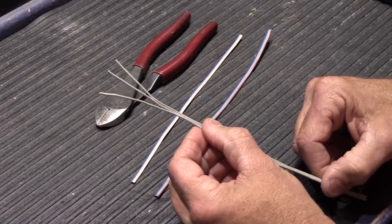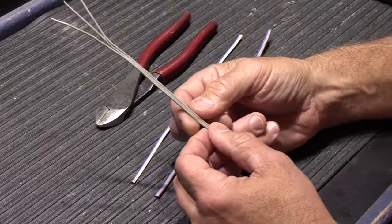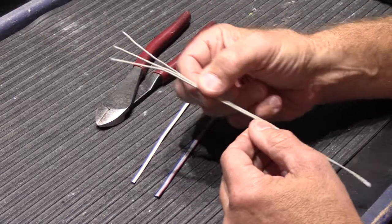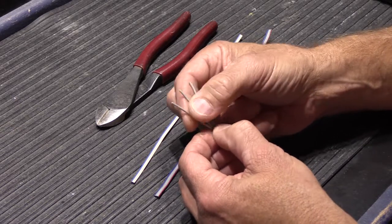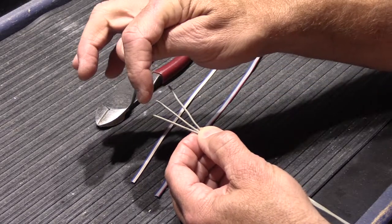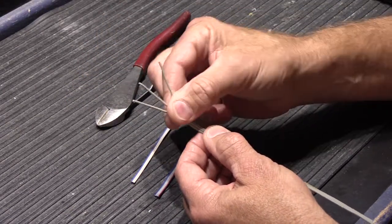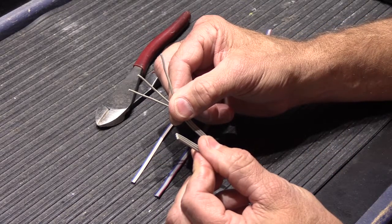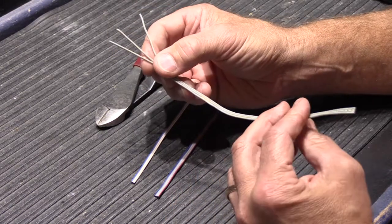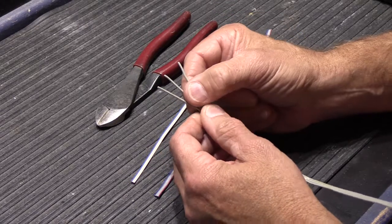This early piece of IW3 is a flat parallel three-conductor cable and the insulation on it is all gray — flip it over on either side and it's just gray insulated wire bonded together. This is an original piece, probably from the mid-1960s. When an installer would go to hook this up, he would have to identify which strand is which at each end, because one end might be at a bedroom station while the other end is behind the master station, and you have to hook up the correct conductor at the same terminals on each end. That's done not by the color of the insulated jacket but by the color of the actual wire.